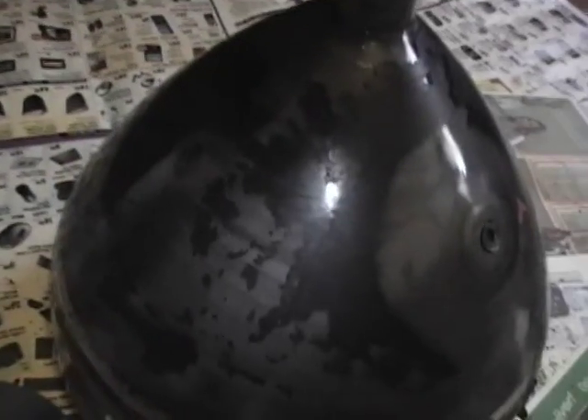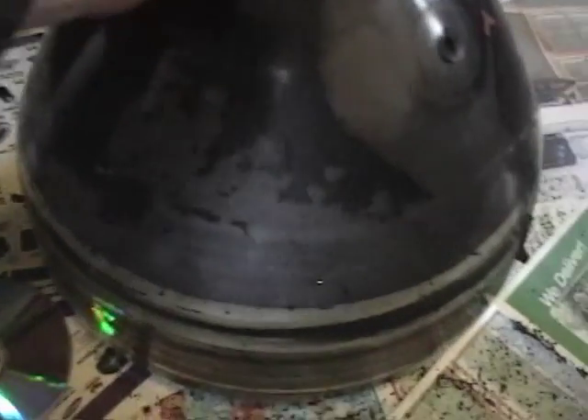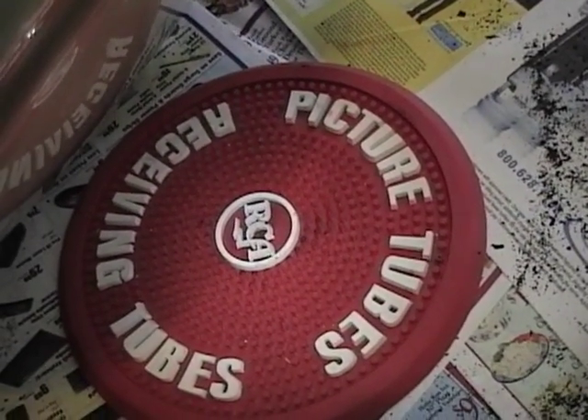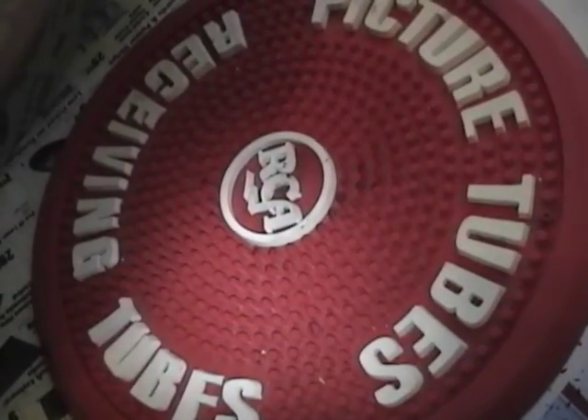Once that's all off, I'll clean the glass really well, then mask off certain areas, and spray this on. I should also mention that I don't have this picture tube just sitting on newspaper on the floor — you don't want to scratch it, you've got to protect it. What's actually under here is something I got off eBay: an old picture tube mat, with little rubber pegs sticking out so you put the face down on it and it forms a nice cushion. Kind of a neat thing to have when you work on these old tubes.